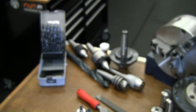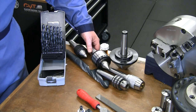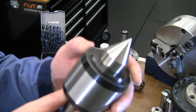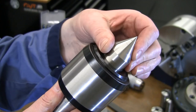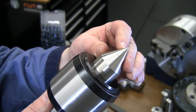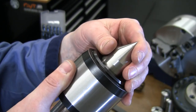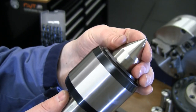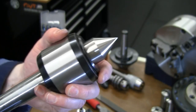For anybody doing a significant amount of machining, you'll want to invest in a live center. With a live center, the tip has ball bearings and turns with your piece — all the friction is against ball bearings inside. It can handle a lot of speed, doesn't generate heat, and you don't lose accuracy off the tip. This particular live center came from Grizzly based on a recommendation, and it has worked well.